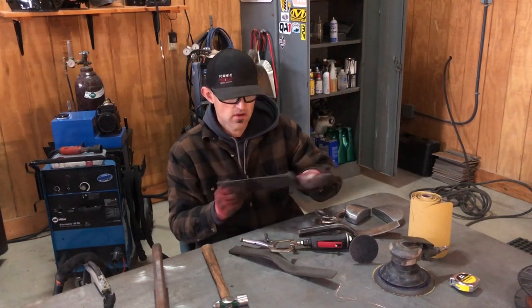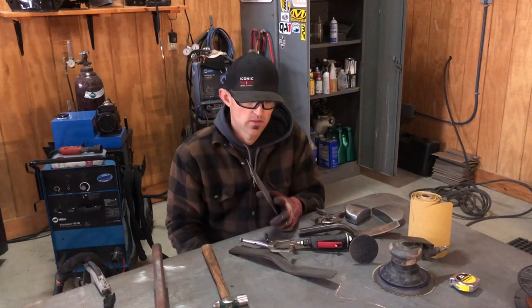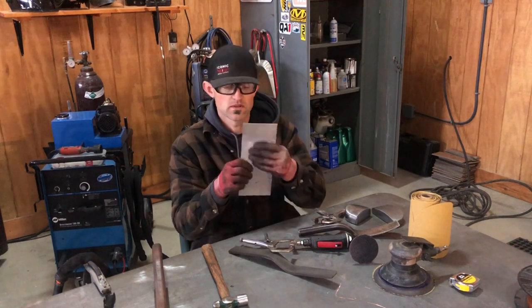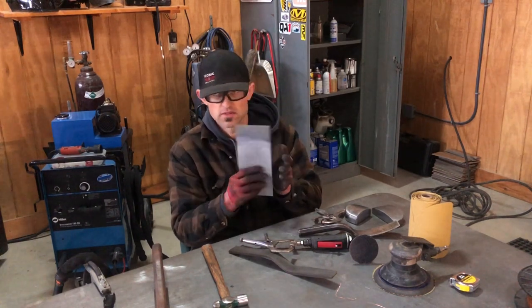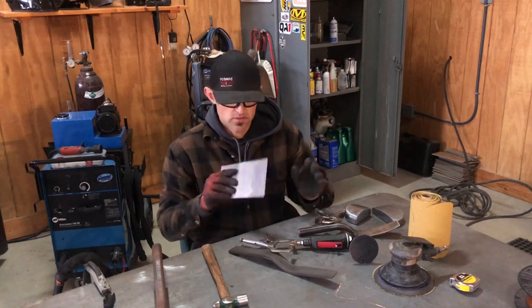This is how all the guys you see on TV doing it, it's the correct way. We don't lay on another piece of metal and spot weld it when it's rusted. I mean, we cut it out, we weld it in to where it looked like it was never welded. We make fenders, door skins, you name it, we do it all this way.